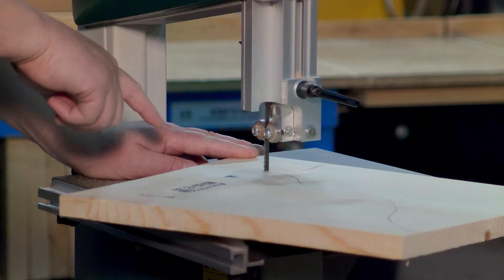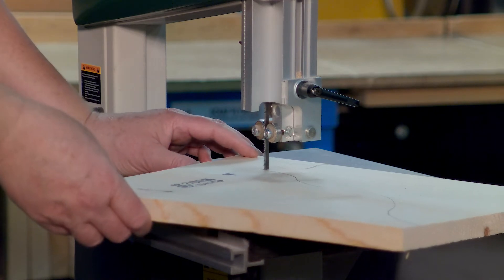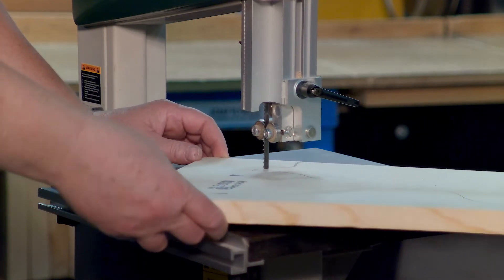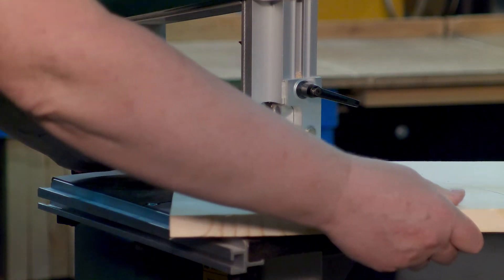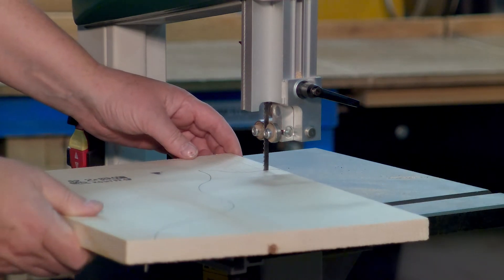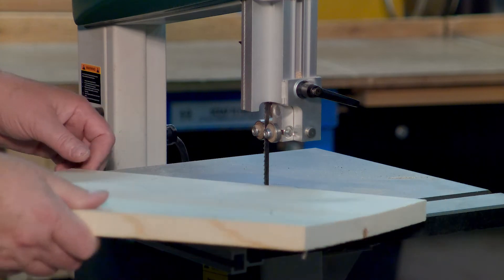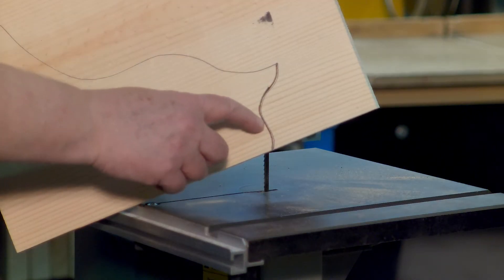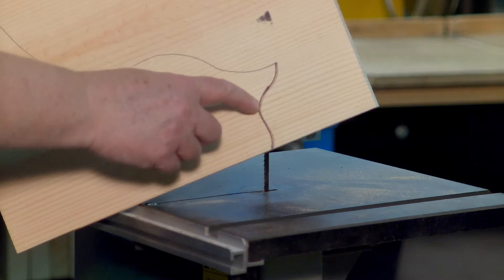When I get into the corner, that's when I want to back my blade out gently and carefully without pulling it off. This is why backing it out while the blade is running can be problematic — it can quickly knock your bandsaw out of whack. I did have some trouble taking this corner and had to make it in short little steps, correcting every step of the way.